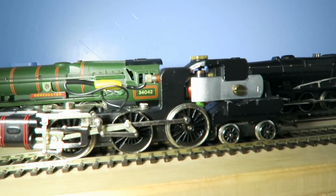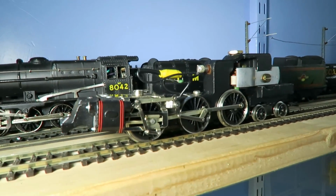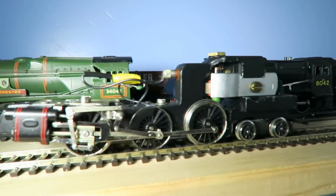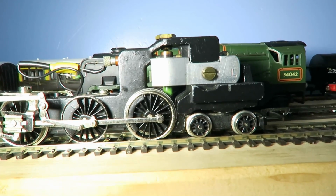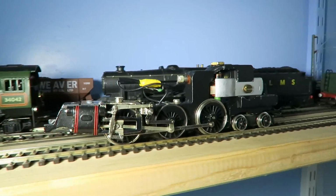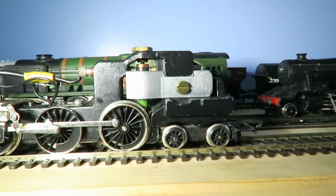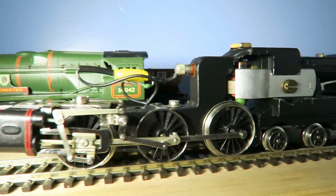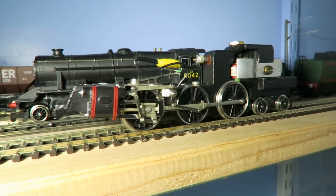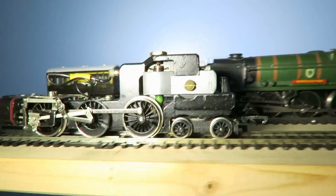Here's the Wrenn 264 mechanism, which featured in my other video, which you probably saw when I was trying to get her noise sorted out. Now when I opened her, she didn't have any ball bearings either end. Whether they were never fitted, I can't actually remember having the motor apart to the point of taking the armature out before, but maybe we did. She's been with us many years, but funnily enough, now she's got a ball bearing both ends, silky smooth. Does draw just over 300 milliamps, but that could have simply been a motor type.